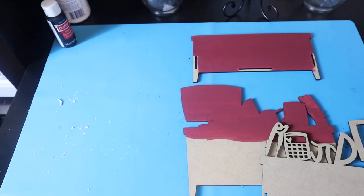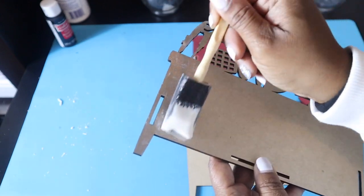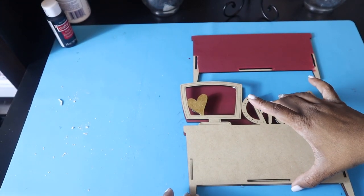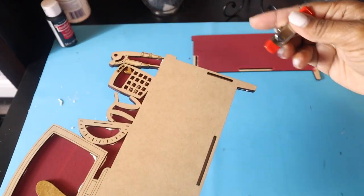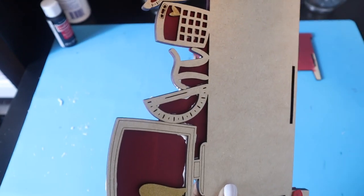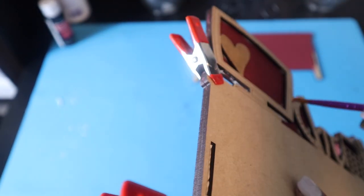I am going to use a little bit of Gorilla Glue — definitely let that paint dry first. I let it sit for maybe about an hour. Here I am just applying a little bit of Gorilla Glue onto the back side of the wood so that I can put it together. Don't glob too much on there because you really don't want that glue to seep in between the cracks. I have a little glue spillage, so I'm going to get a brush, but first I'm going to get some clamps and clamp that together so that it does not move and the glue and wood can really gel together. I am going to let that sit for a little bit.